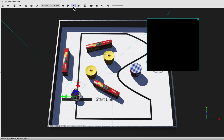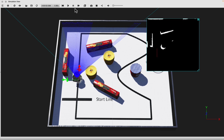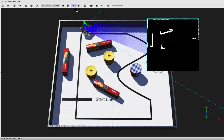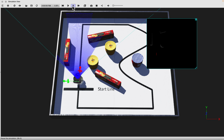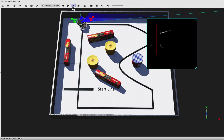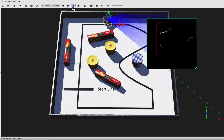Finally, there are different ways of dealing with noise. Instead of simply writing down every point on the map as the laser sees them, we can also say that whenever a point gets registered, we add 1% to the chance of an obstacle being there. And now you see the obstacles are emerging out of the dark, and the more often the laser hits on them, the more likely it becomes that we have an obstacle there. So this is very powerful in conjunction again with thresholding, where you can very easily remove noise.